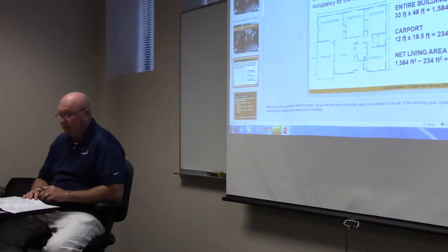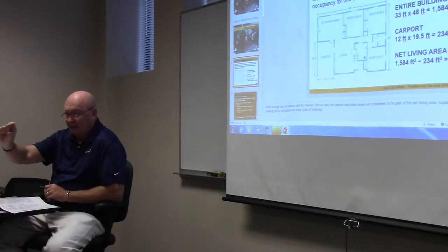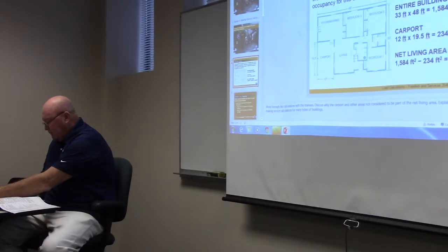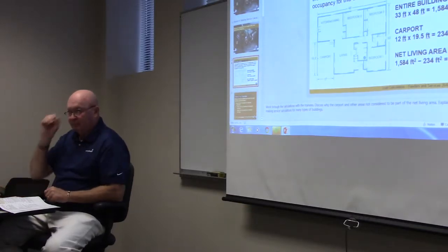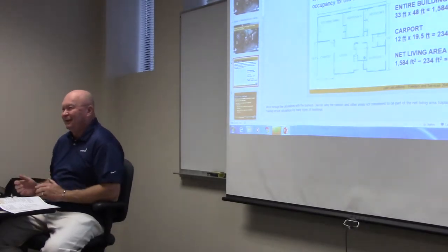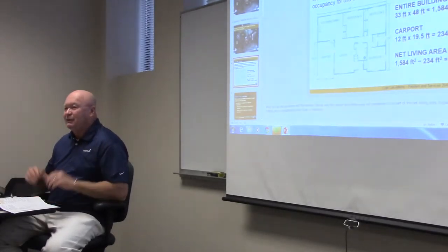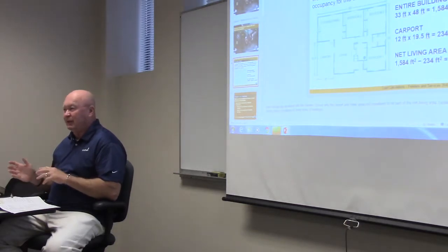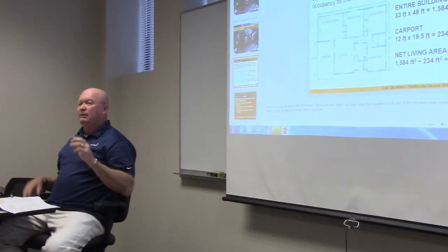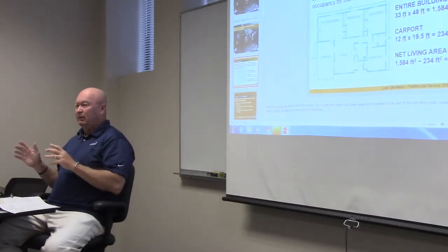Motor nameplate. Found that on page 22 under optional calculations. It's actually in that highlighted square there at the top, isn't it? And motor, now what is motor nameplate? Where do you find motor nameplate? On the motor. Thank you. On the motor nameplate, which is on the motor. And so that's actual full load amps, right? And we may need this later, because that's actual amps is what's listed on the motor.